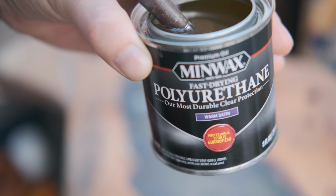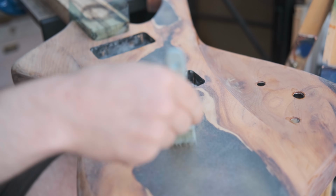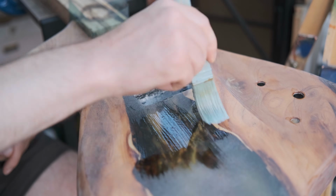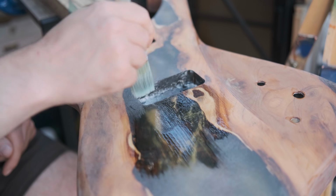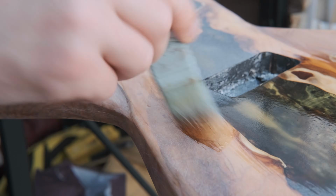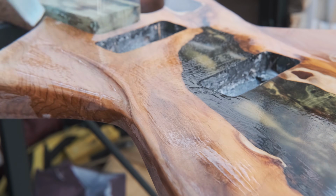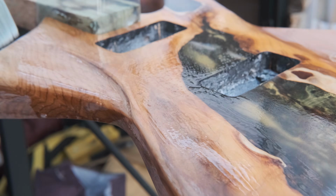Once the surface is level again, I apply several coats of satin poly, as that is the finish that will best suit the guitar. It's the same as with the epoxy. Afterwards I level sand and then I hand sand all the way to around 2000 or so. This will remove all the tooling marks, readying the surface for cutting compounds afterwards.